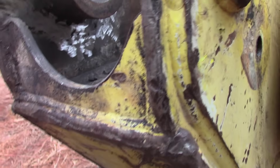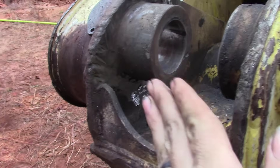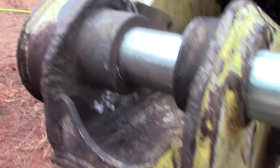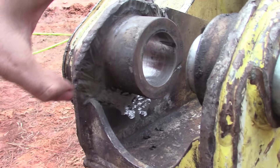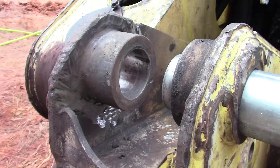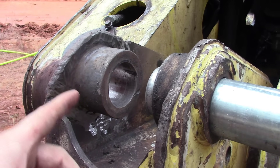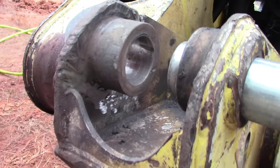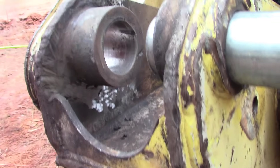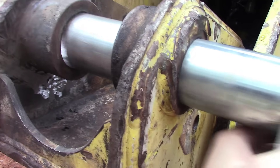Well, we got the crack welded up - it ain't perfect but it's not bad through there. The problem now is since I've welded so much on this side the pin will no longer even try to fit. The problem is the plate that I gotta weld on has got to be on this side too, so it ain't gonna do nothing but draw it more. We're gonna make a plate, test fit it and everything, and we may have to heat this ear on this side and hit it back that way. This is gonna be a pain in the butt.